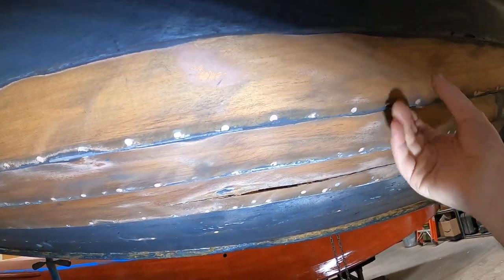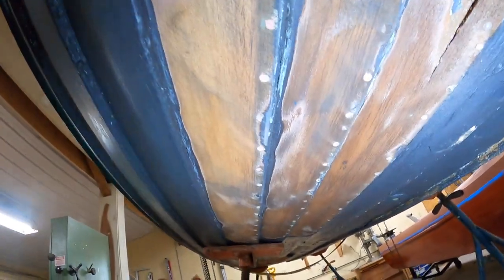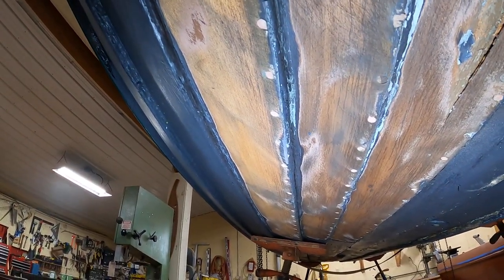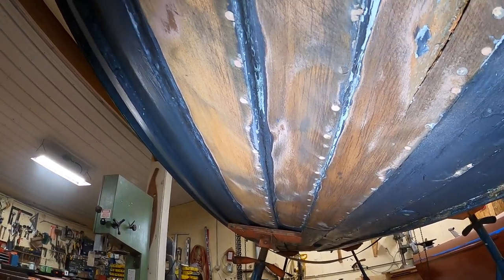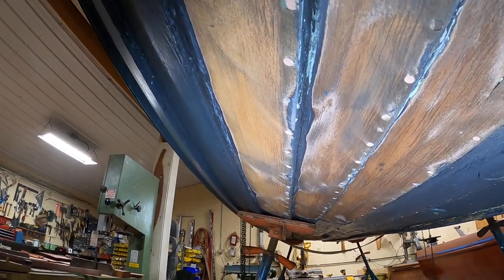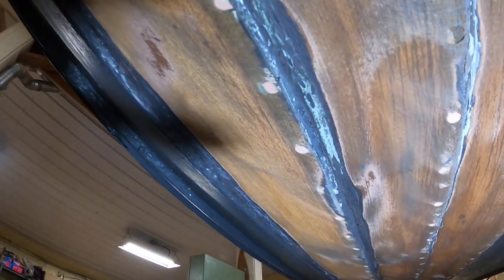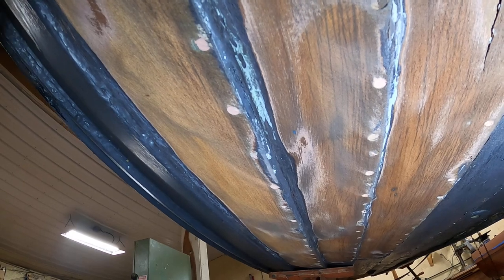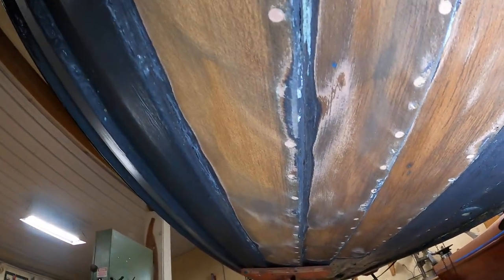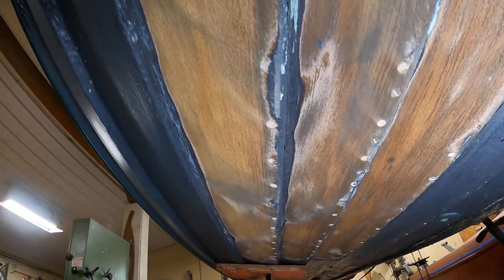What's the right product? When you have it assembled and you've cleaned out the lap seam of everything right down to bare wood, what you want to do is seal it with 4 full coats of Smith's clear penetrating epoxy sealer, and then reach for Total Boat ThixoFlex flexible adhesive. That'll do it. That's what we will eventually do with this boat — clean out all this crap right up to bare wood in every one of these seams. That's our bottom update on the 1957 19-foot Century Viking. Bye-bye for now from Snake Mountain Boat Works.